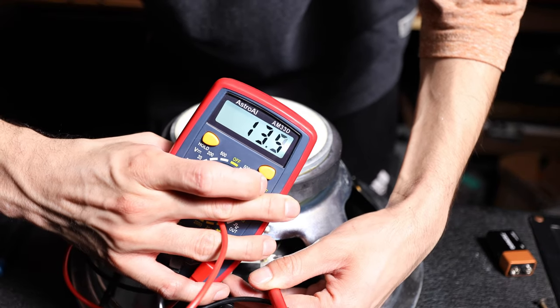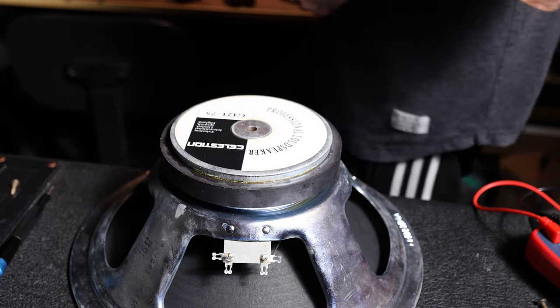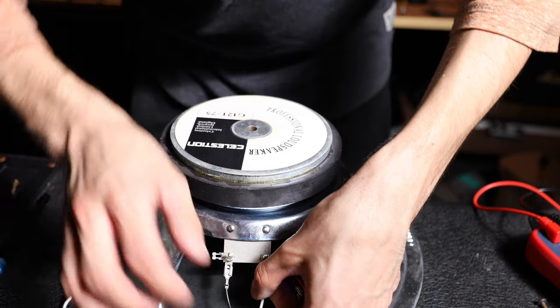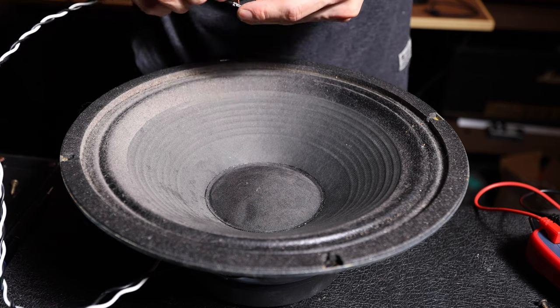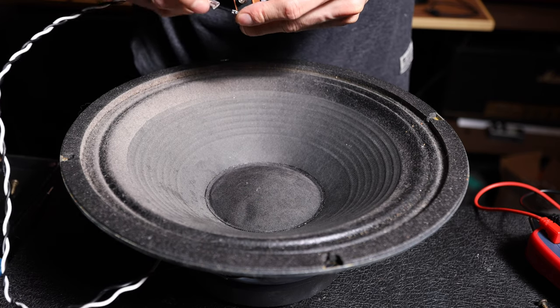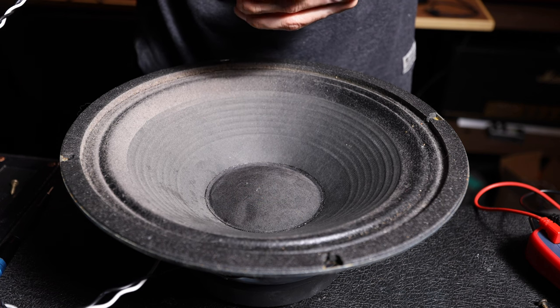Here's the one from 1994 — same deal. Make sure the ohms are correct. It's rated at 16 ohms and I'm measuring 13.4 — 13.5. Good enough. Now I'm going to test for correct polarity: white to positive, do the battery test — it goes up. Switch the polarity and it goes down. Perfect.